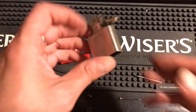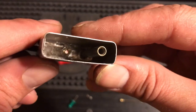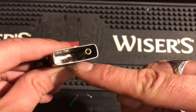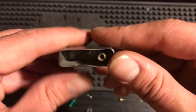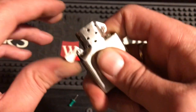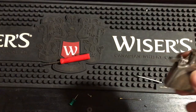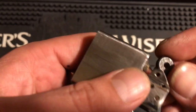I took my punch and pounded it nice and smooth. Push from the top as much as you can into the hole, so when you mushroom the bottom you have as much material left over. You can see a wick totally fits through there, and the cam is completely fixed and tight — you can hear the knock on it. I had it in the Zippo and it was working fine.